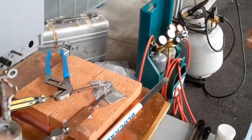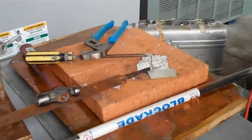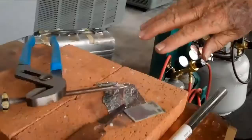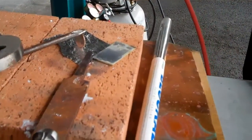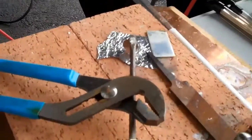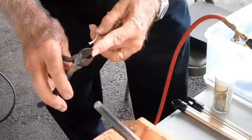Kitchen foil. It's extremely thin. I'm going to attempt to do this by directing the heat away from the aluminum. I'm just going to try and keep the heat on the piece of copper tubing. And first, I'm going to cut some very small pieces of Stabrite alloy.